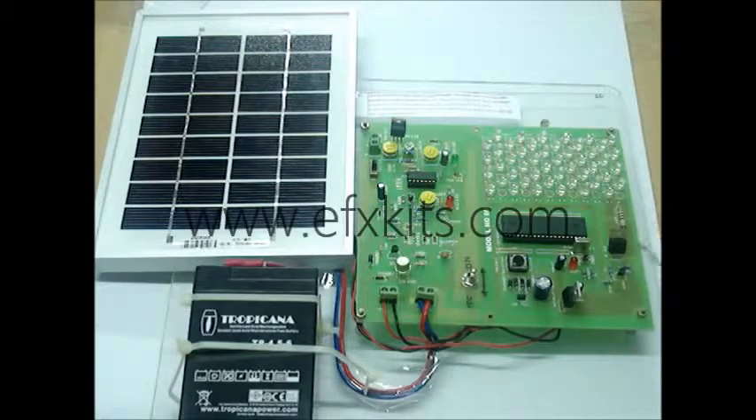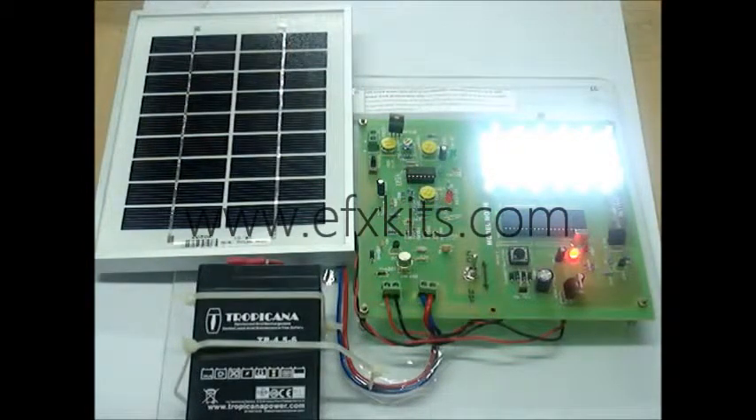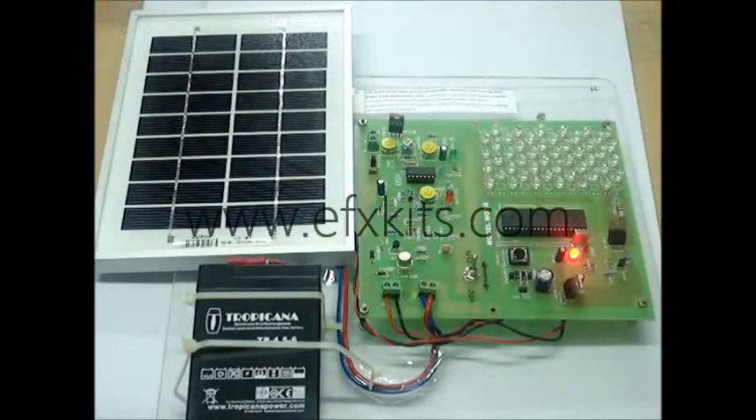This section is the load, where we have a microcontroller and a set of lamps. When switched on, the lights glow and their intensity progressively falls until morning. The intensity decreases based on pulse width modulation (PWM) that has been provided, and finally the lights switch off.